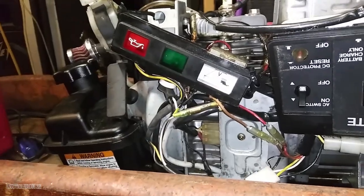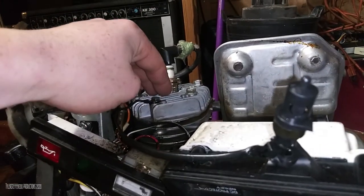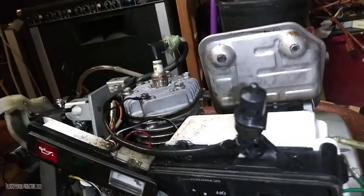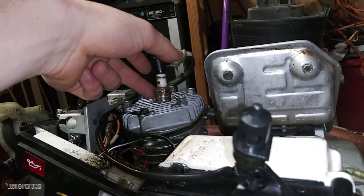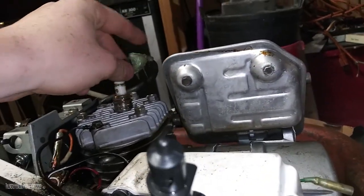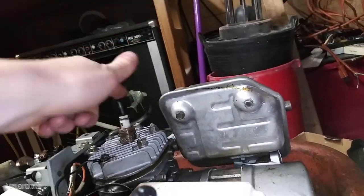This engine is probably around 70 cubic centimeters - probably a little bit less. My friend told me a trick where you lay the head on a very flat and level surface, take a ball-peen hammer and a piece of plywood, lay the plywood on the head and smash it - the idea is you can increase compression a little bit. I also re-threaded the spark plug threads because I didn't like the way it was threaded originally, and put in a pretty decent high quality plug.